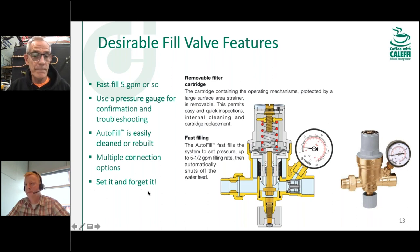We call this a set-it-and-forget-it valve. One other feature to point out: the knob on the bottom is actually a shutoff. It's stamped with open and close arrows. If you're of the opinion this valve should be left off when you leave, you can turn this knob to shut it off — it's a more discreet or stealth shutoff so that someone coming back the next day doesn't inadvertently open a ball valve you intended to leave closed.